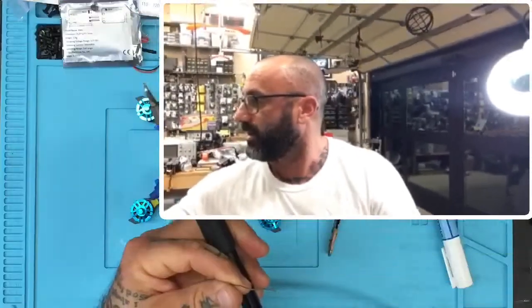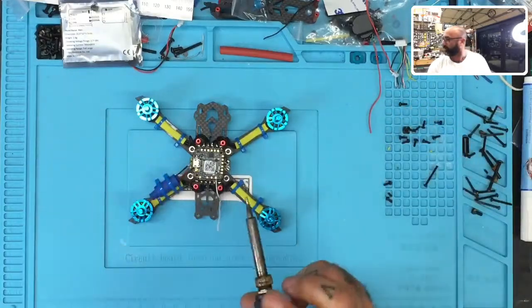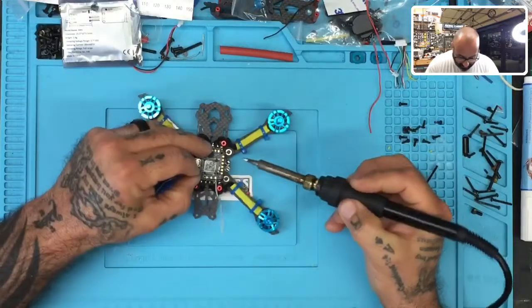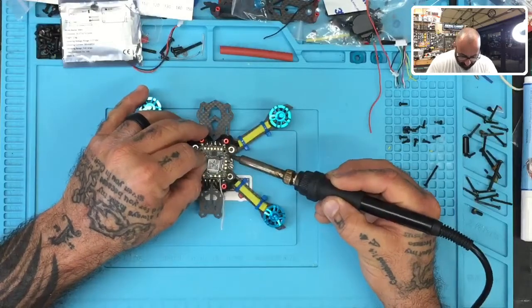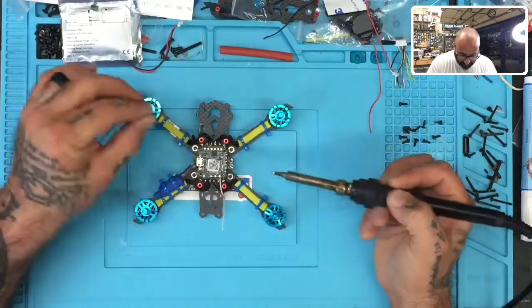So now what we're going to do is get back to business here, and here we go. Again, pardon the screws, all these came out during the work, but what we want to do right now is pre-tin the board. So I'm going to get ready to do the receiver. I'm just going to tin very quickly. Now, if you want to see how well this works, it's easy, I'll just run this straight across, and boom, all my pads are tinned at this point, okay?